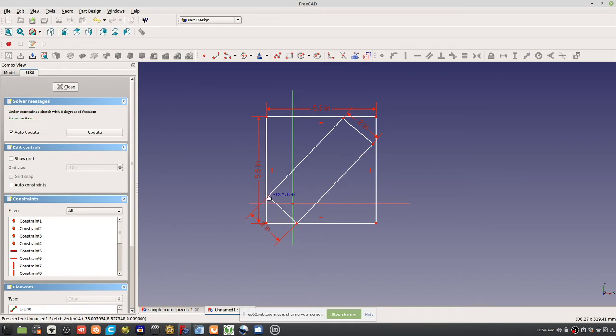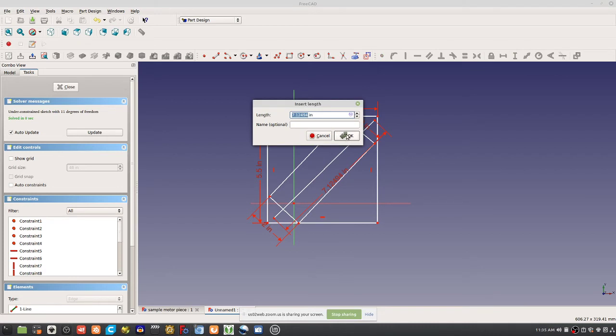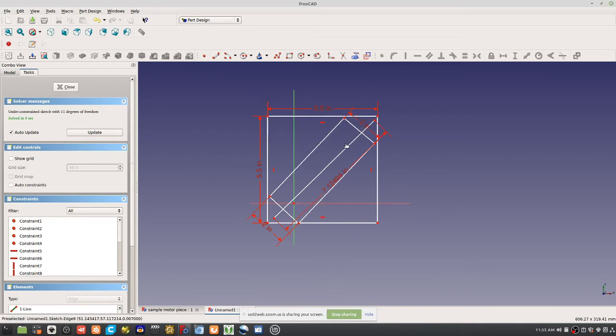But you can think about, if you have a narrow thin piece, because the diagonal is a little longer, right? So how long is the diagonal? You can easily fit something that is 7.1 inch. So you get like an extra 1.5 inches if you print something across, if you have a narrow feature. So that's just some considerations to think about if you're designing for printing.